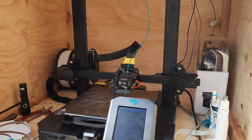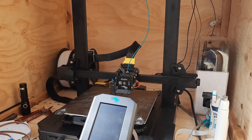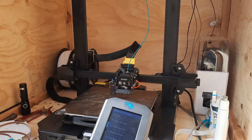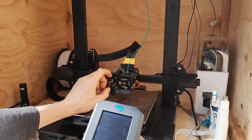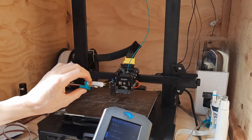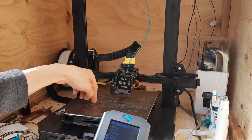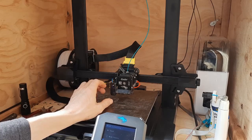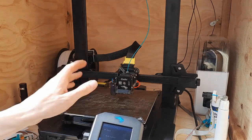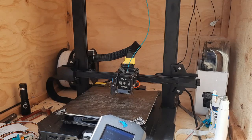What you have to do once we swap this over is change the probe offset location, which is also in probe settings. What's good is you can actually change that probe offset location without resetting your mesh. You can leave the probe position at 0,0 - which is where the nozzle is - and still just home. Once you've done your mesh with this other bracket, you're only really using this probe for getting that initial Z level home. For convenience, I'll just leave my probe offset at zero even after swapping back.